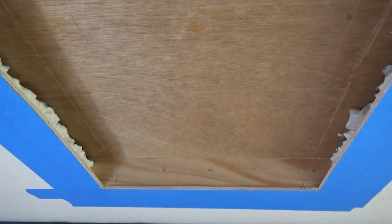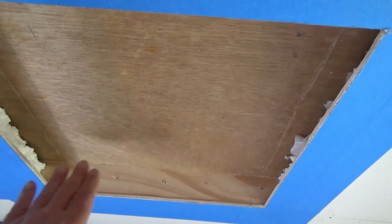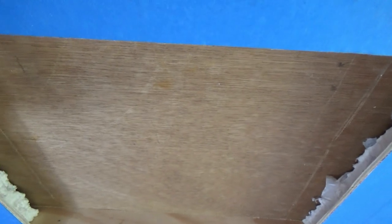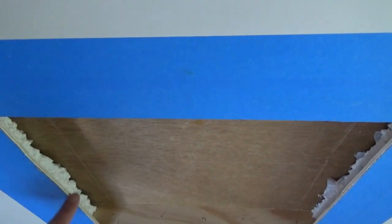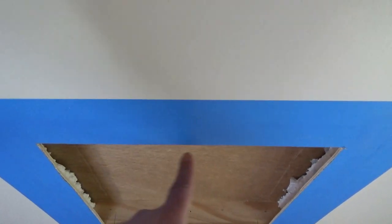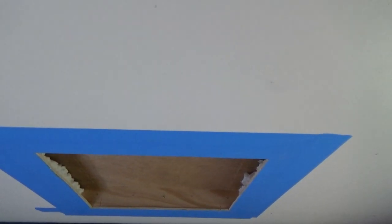So this is what we have so far — we have the hole cut in our ceiling here. I did my best to chunk out some insulation on the sides. I've got some inch-and-a-half wide wood that I'm going to put in here using pocket hole screws on each end so we have a nice enclosed area. Then we'll probably just take a router real quick to clean up the edge, and then we'd be ready to cut the hole on the outside and get the vent installed.